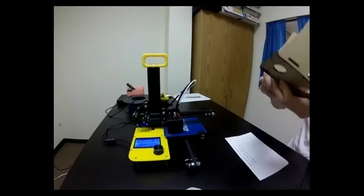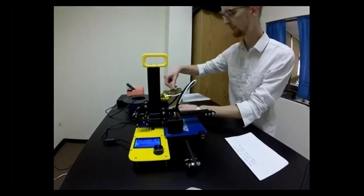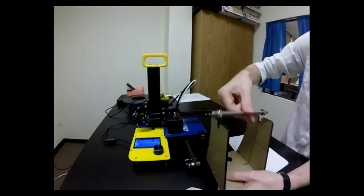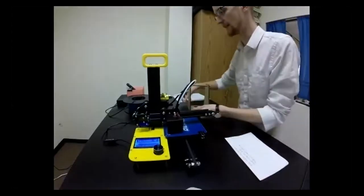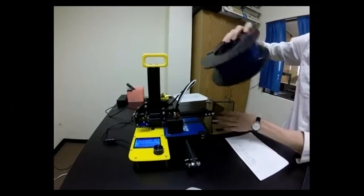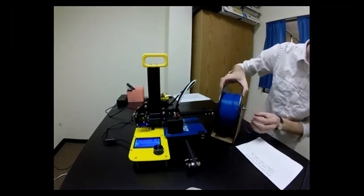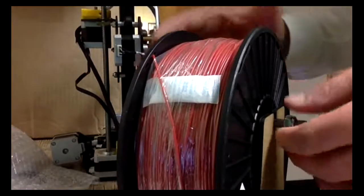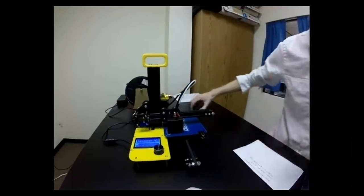The spool holder and filament are set up correctly. We can set that aside. The printer looks good — it's just placed really high up compared to the instructor's setup. Now we're going to auto-home — put it to its origin point at 0X, 0Y, 0Z. Click the button once, go to Setup, then Auto Home. The printer will move to its home position on all three axes.